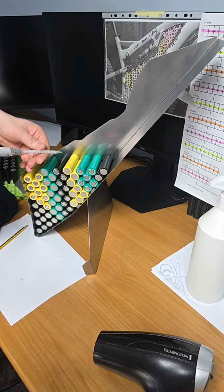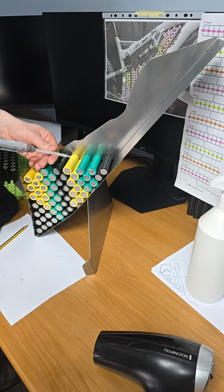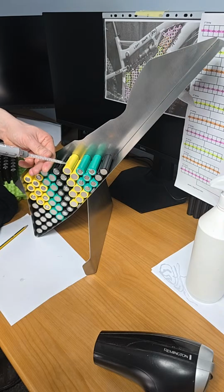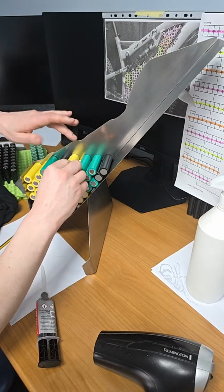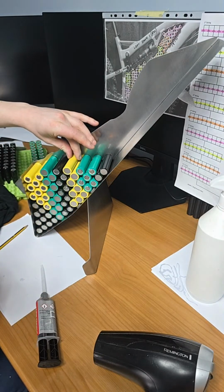Right, so this time I'm going to just place the glue on the cell nice and even. So the reason this glue is not going off on the applicator is because it's moving. It's not sitting in the one spot. And just to point out here, you can probably tell the negative pole of the cell's facing out, which it should be in that pack.